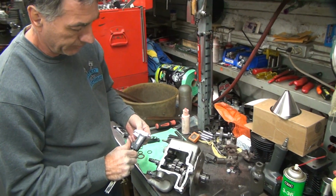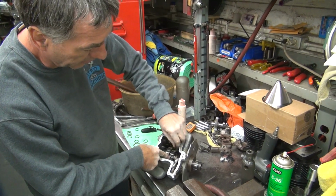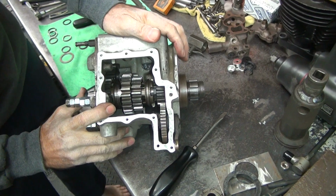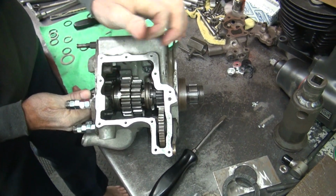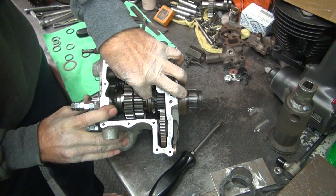This one over here is supposed to be in there. So that one will tighten up this one, because you've got to check it with all the clearance going that way. You put clearance on here and you check your minimum. That's your minimum clearance. Pulling out this way will be your maximum clearance. You don't know what the chain's going to do, so you always want to make your clearance minimum when you check this one.